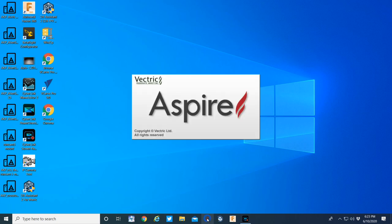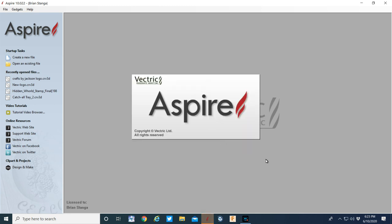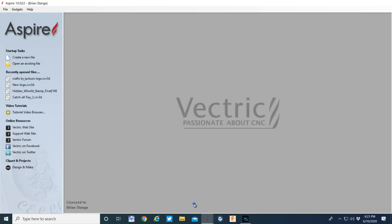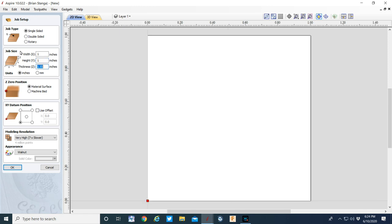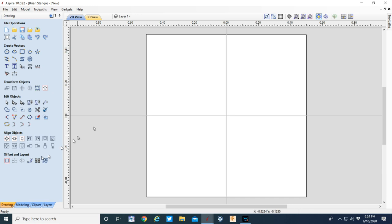Let's start on the software side of making this brand. I'm going to start by opening up two versions of Aspire. One is the one where I've done the work, and we'll open up a new file in Aspire just so I can briefly show you what I went through here to get this done. So I'm creating a new file, setting a stock for 1 inch by 1 inch, and that's the size of the brass round that I'm using. And we'll be working off the center.